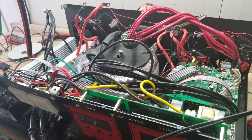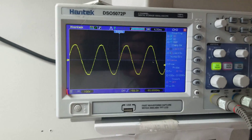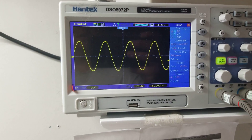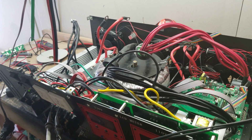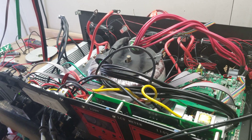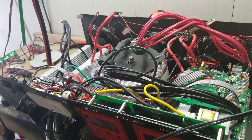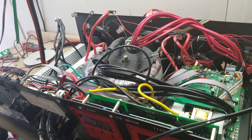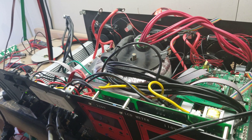So how exactly did I fix this problem? First of all, let's discuss the problem itself — some of you may not even be aware that you have it. The noise can vary from just a little bit of line noise all the way to being crazy off the charts. What ended up happening was during the 2017-2018 transformer phase, PowerJack was getting transformers from a third party using a bad core. The iron ferrite core used for these toroids was not as pure as it should have been, and it was causing line noise.